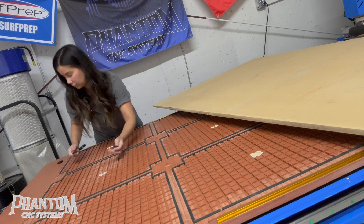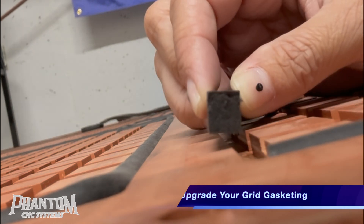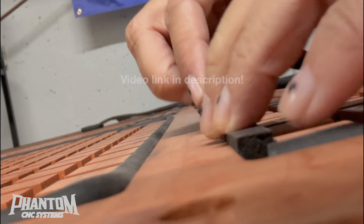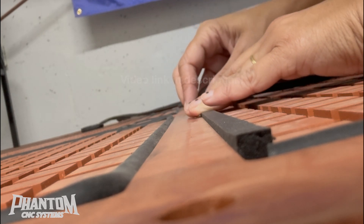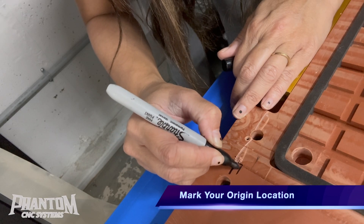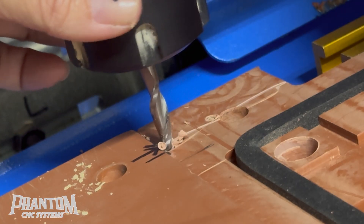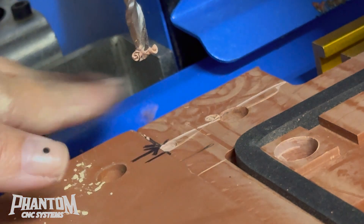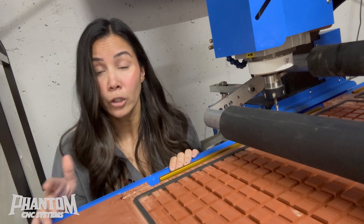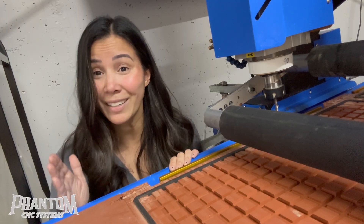Now it might be a good time to point out that I've upgraded from the standard round gasketing to the square gasketing. To understand how this increases your vacuum table's efficiency, see Phantom's Upgrade Your Grid Gasketing video on YouTube. It's important to mark your origin location on the machine bed itself. To mark this XY coordinate, I'm going to bring the bit down to my machine bed surface and manually rotate it to mark that position. This will ensure that both at initial installation and when swapping out spoil boards down the road, you can run the exact same file from the exact same origin location and know everything will be vertically aligned perfectly.